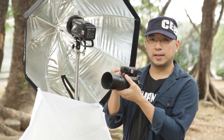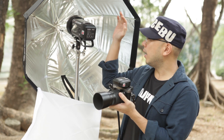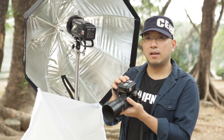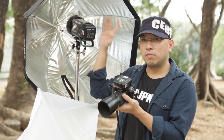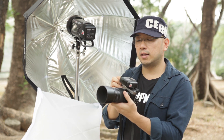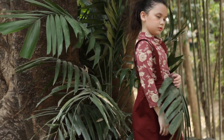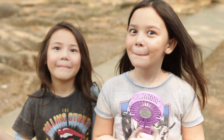What's great about the Godox system is I can use the trigger and control everything from my trigger. If I want manual, I can change the mode to manual, and then it's manual right there. If I want TTL — through the lens — I can just change the mode again to go TTL. And one thing I like the most about the AD400 and the Godox system is all their flashes in the AD series can do high sync speed.